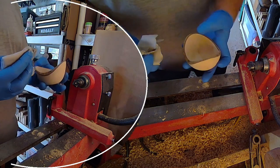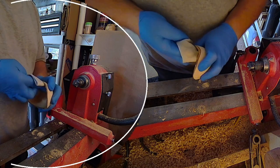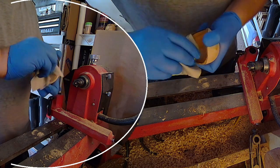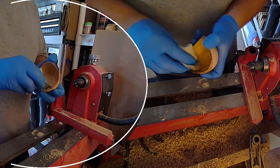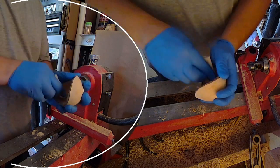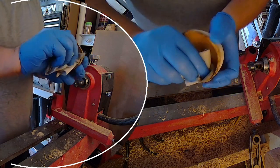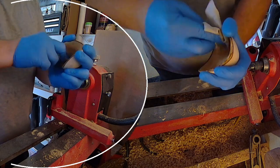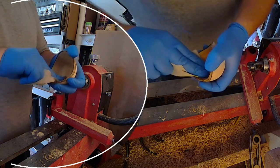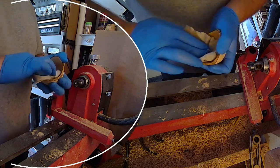I'll come back with some of my homemade Obi Shine juice type stuff as well. But this here is going to help seal up some of those pores. Make a little bit of a nicer, smoother finish. And no, you don't have to have it on a lathe for this to work. You just throw some on, get it rubbed in real good, and find another part of your rag that's dry. Give it a good wipe down.